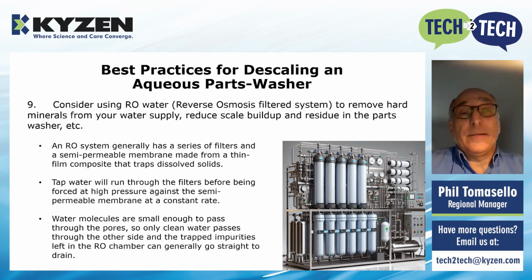Then I really think it's important to look at considering the use of reverse osmosis water. And there are RO systems out there, large systems, small systems that you can look at. But these systems are great because they're by design physically removing those minerals that we mentioned, by forcing water through a semi-permeable membrane, right? And you've got water molecules that can go through the membrane. You've got all those other minerals that cannot. So you end up with clean water to start.